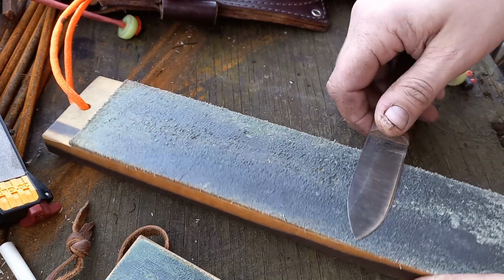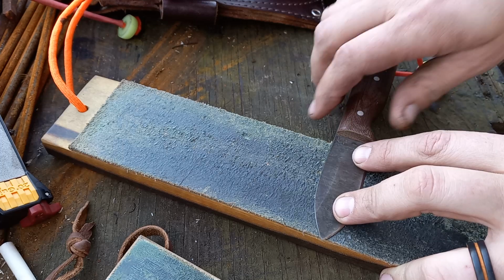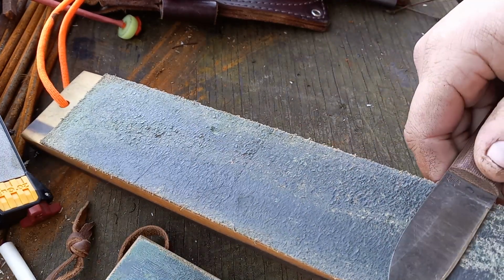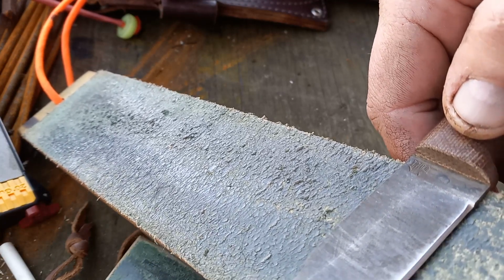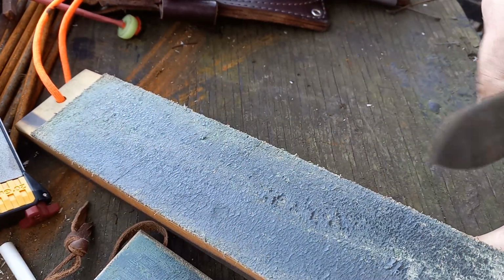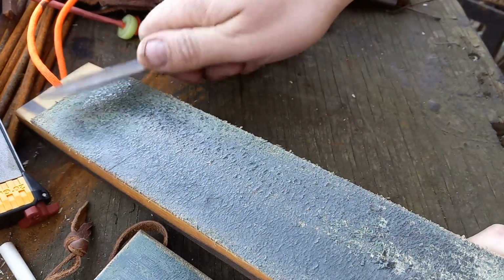And it's going to be the same way. You can lay it on there and you can feel it when it gets right. There's a certain way that it's supposed to go, and that just takes practice. You can get where you can do it with one hand to get that angle that you want. And also, like the plunge, you don't want to lay it where it's on the ricasso or however you pronounce it, but you want the plunge line to be where it's touching. And I put a decent amount of pressure behind it when I do it. That's just something that you'll have to practice.